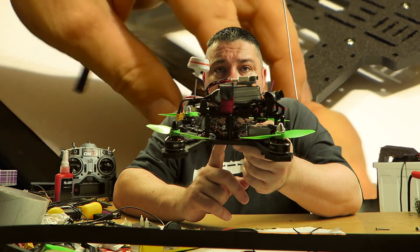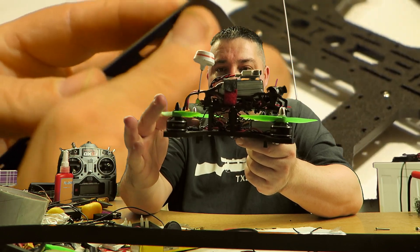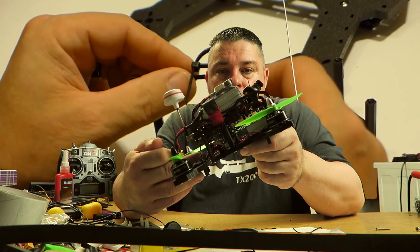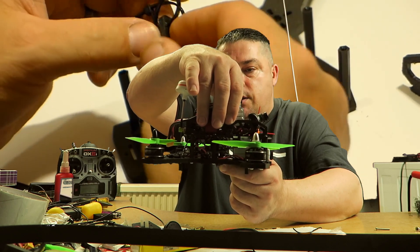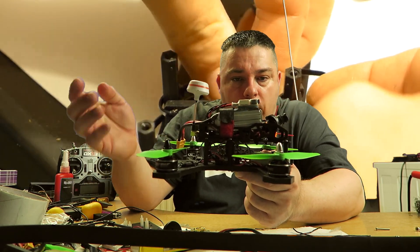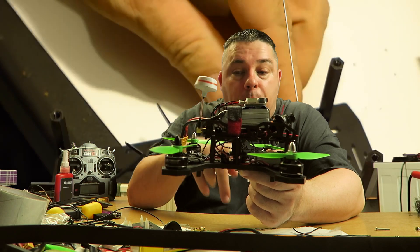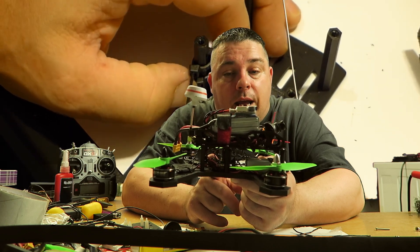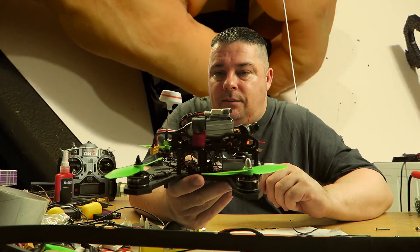I like the layout. At this precise moment I've chosen to run the CC3D flight controller dead center of the chassis and not mount my batteries in the back, because the batteries I've got actually force the CG too far rearward. So I'm running my battery right on the CG in the cradle up top. When I've got time to refine the build I will mount the battery back in its correct place and put the bulkhead in — which is included in the kit — so that if you do have a head-on accident it protects your flight controller.